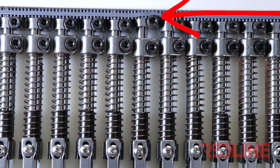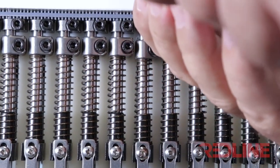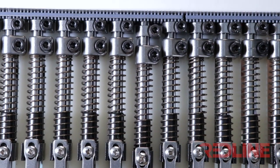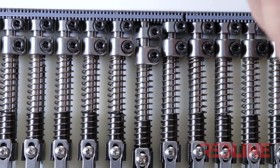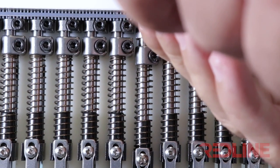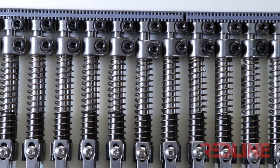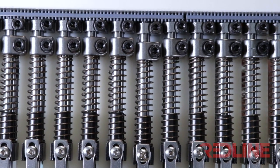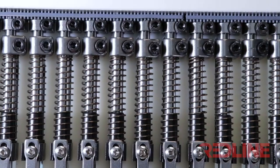To readjust the upper ring, barely loosen the screw of the upper ring. Once the upper ring is barely loosened, do a full round on the main shaft to release the pressure. Once you confirm that there is no pressure on the upper ring, tighten the screw. Then press the 100 degree icon in your control panel and load the needle manually to confirm the needle is coming down. If the needle is coming down, you have finished the adjustment. Press the 100 degree icon, reinstall the covers, and your machine is ready.